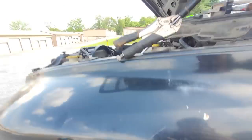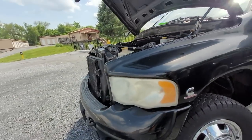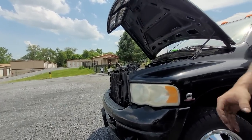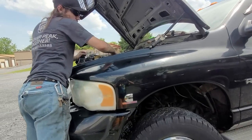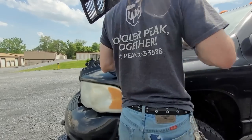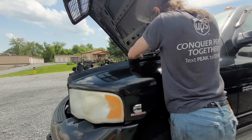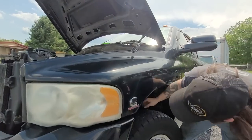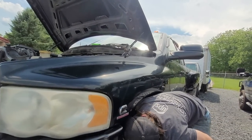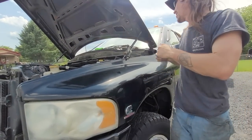Oh, I heard that — wait, how is it starting without using a key? Oh, I heard that — that's fuel. It's trying. We have a running engine! Listen to that — now we don't have any coolant in it, just basically wanted to hear it start. No key — we didn't put the key in; the ignition switch isn't working with the new key for some reason. Let's shut this off. Okay, the fuel shutoff works! Let's see if it starts itself back up. I just turned the fuel back on — I'm going to give it a little bit of throttle just to make sure the pump is on, see if it works. And then we know this pump is saveable. Look at that — pump's saveable! That's a good sign. Awesome.